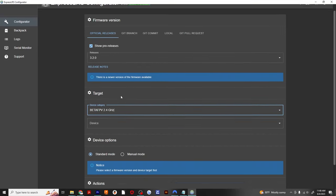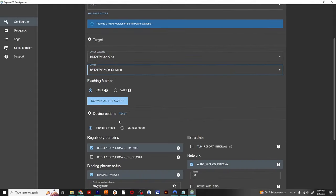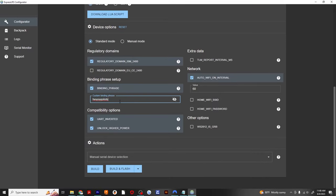Because it's built into the hardware, you will have to flash it a different way. With a normal ExpressLRS receiver, you jump into the ExpressLRS Configurator, compile your features and settings, type in your binding phrase, hit build, and flash it via Wi-Fi right onto the receiver. You cannot do that with an SPI receiver because it is on board.